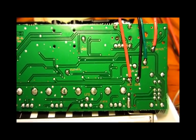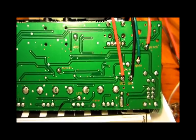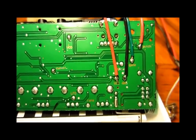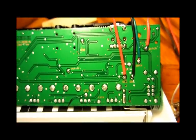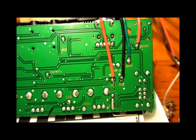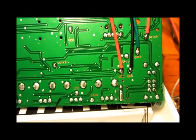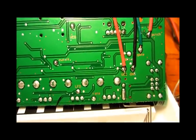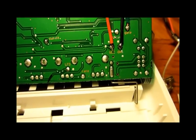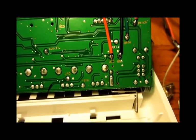Tonight I'm going to try to add a square wave to the VCO of the Monotron. They have these really handy patch points located on the back. Pitch and gate are how I made pitch and gate controls — it's a very straightforward thing to do. And then they have VCC and ground here, VCC being the supply voltage, so it's probably three volts or something a little bit less than that.